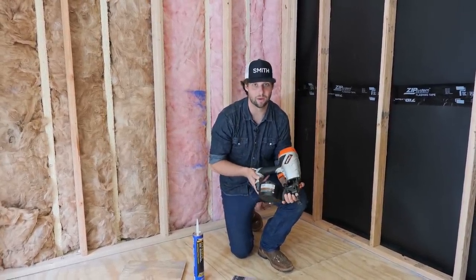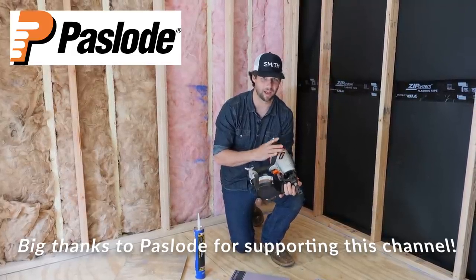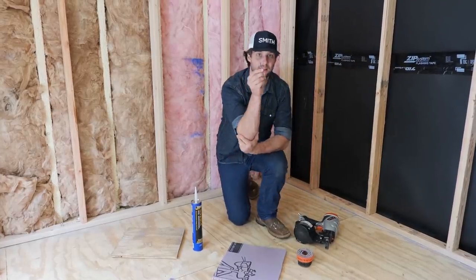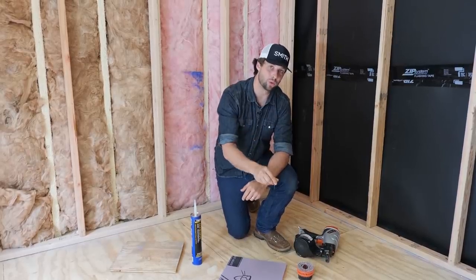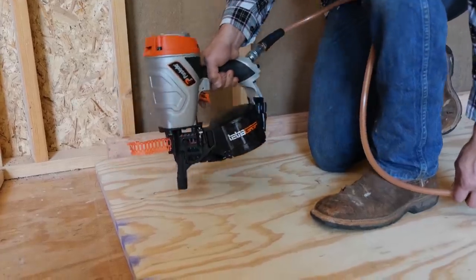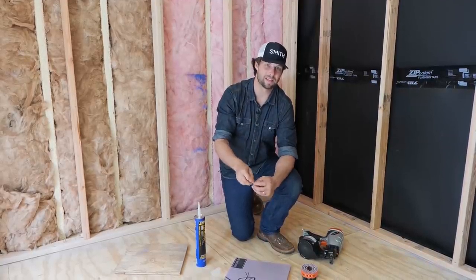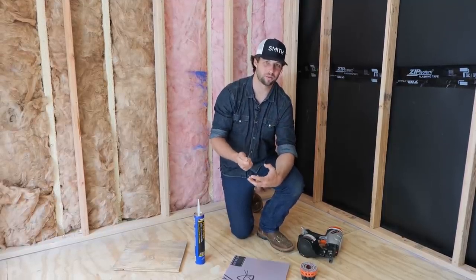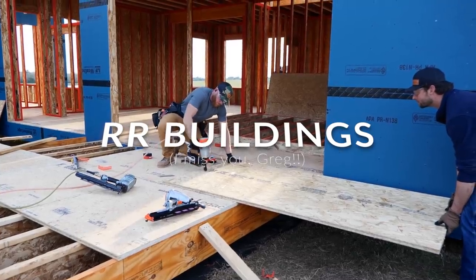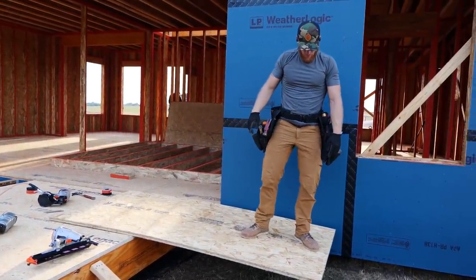To combat that, we use the trusty Paslode TetraGrip subfloor nailer. You've seen this before — this is what we used on our last farmhouse to attach the subfloor. Phenomenal gun, one of my favorite products from Paslode. What you have is a threaded nail that actually rotates as it goes into your floor and holds like a screw, but it drives just as fast as a nail — so it's a hybrid system. It gets something like three-and-a-half turns as it drives in, and it's got these gnarly barbs on it. It's super hard to pull out. There's a video where Greg and Kyle and I tested this — we put one fastener on the end of an eight-foot subfloor piece, walked out all the way to the end, and it barely came out even when we were jumping on it. An incredible fastening system, highly recommended.